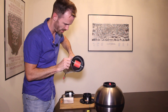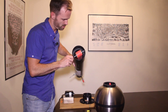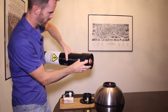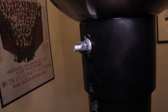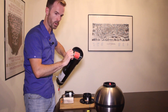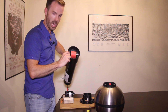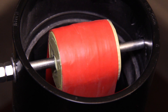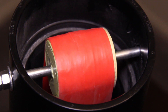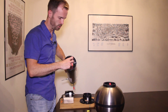The top part works on the same principle as the bottom, except up here I wanted it stationary so I didn't have to worry about the bolt turning. It's got a groove cut in here so I can adjust the height to keep the belt centered. In the top is again a bed caster — I got some vinyl at a fabric store, roughed it up with sandpaper, and glued it on.